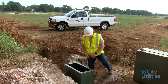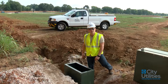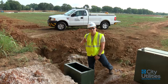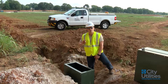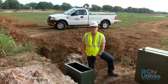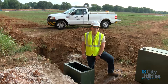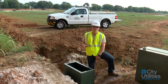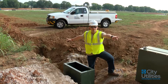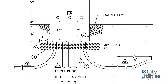The conduit inside is two inches on this particular junction cabinet and we have another one going back out to the east over here. So there are three pieces of pipe in here. They're radiuses — 24-inch steel radiuses — and they are connected to a five-foot piece of steel galvanized. On the end of that steel galvanized is what we call a two-inch FA fitting, which is an adapter, a female adapter, that goes from galvanized threaded to PVC two-inch.